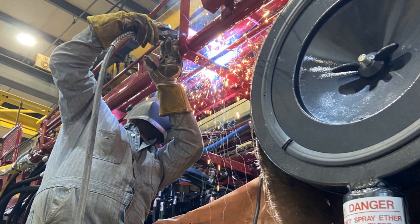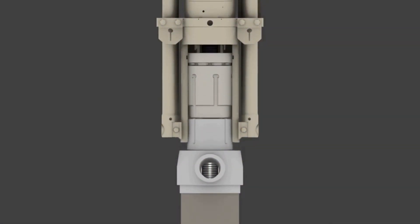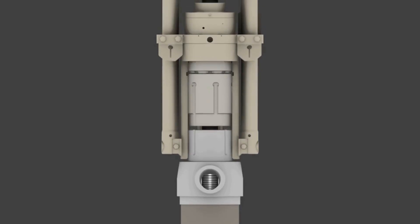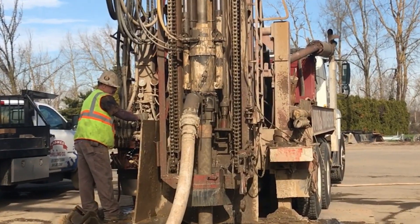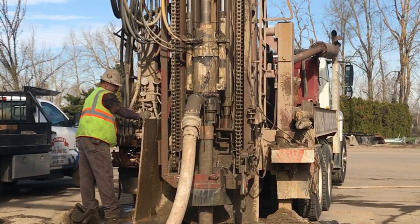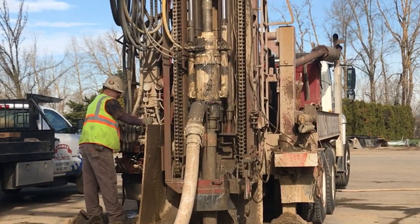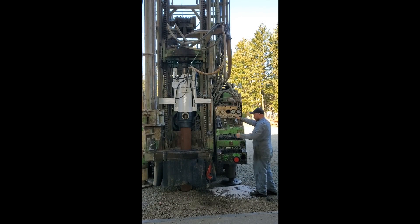The Holt Casing Driver uses air to move a piston that strikes an anvil. As you drill, the bit will get ahead of the casing and effectively push the casing driver into the top of your casing. When the anvil gets tight against the piston, it will start cycling, consuming air at about 1,000 blows per minute. Air consumption is very low — it isn't cycling all the time like a downhole hammer. The anvil is designed with steps on the inside and outside for different casing diameters.